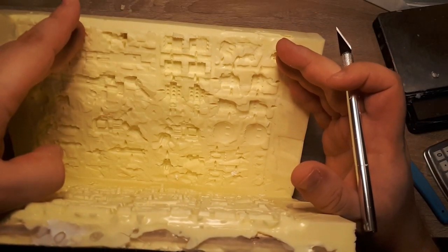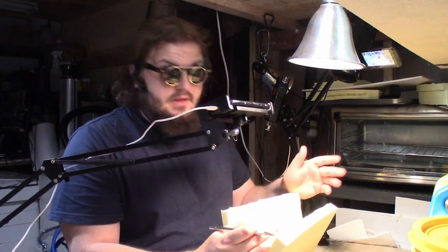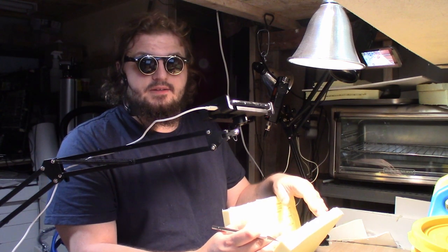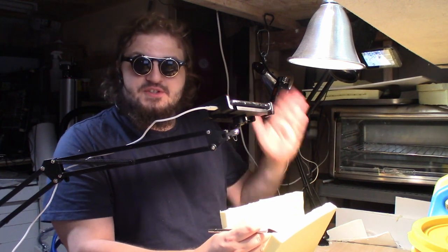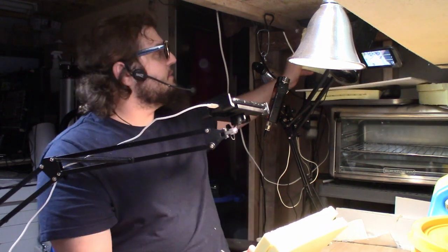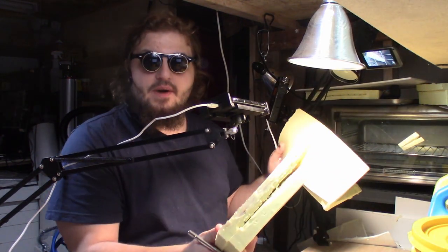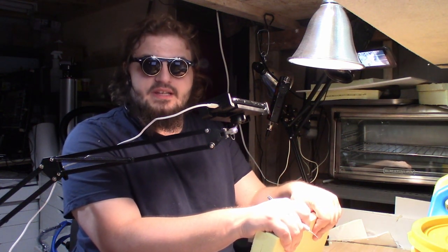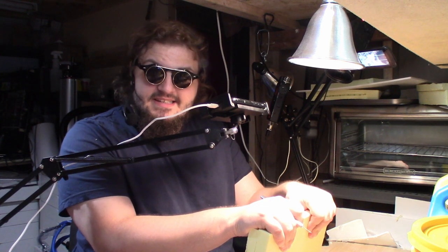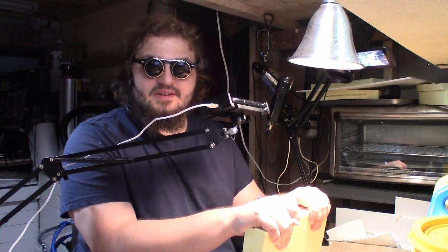Of course, my ideal goal would be to get a mold that doesn't require any additional vents. Hell, that's actually where the idea of placing additional vents with hot glue came from. And I swear, it does work. You saw the first mold, the one that didn't use any of that nonsense with reinforcements inside of the mold. The good old standard cut mold actually worked better than this crap. And I'll be honest, I was fully convinced that it's the inner reinforcements that actually made it better. It didn't. It was simply the extra vents. I'm telling you, man, every recast attempt, I find something new.